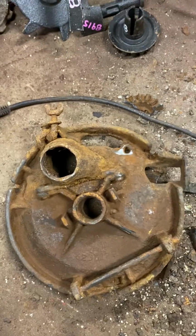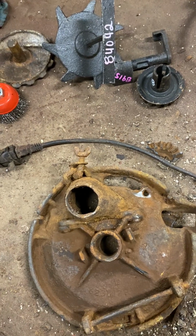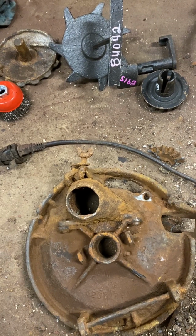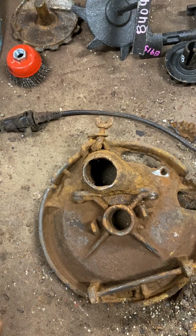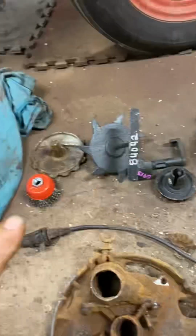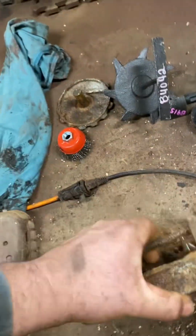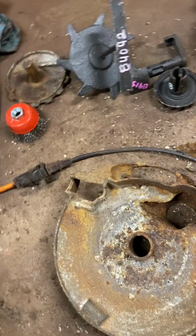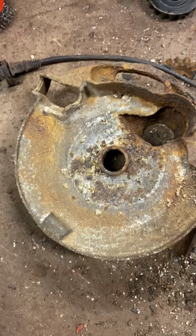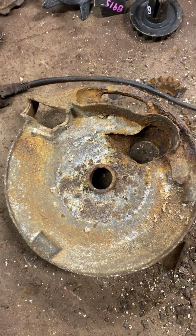And bust the gear off of there, knock the agitator out that way. Clean it up, put some good thick paint on it. Whatever you like. I think I'm going back with black to red. And Agri Supply parts there. Birch Store has them. I'm sure some other vendors online have them. But that's all there is to it. Cut that bolt off there. Keep the cover off the top. The agitator won't come off, or the flow gate. And then just clean everything up. But I'm gonna do a little video of the finished product when I'm done.